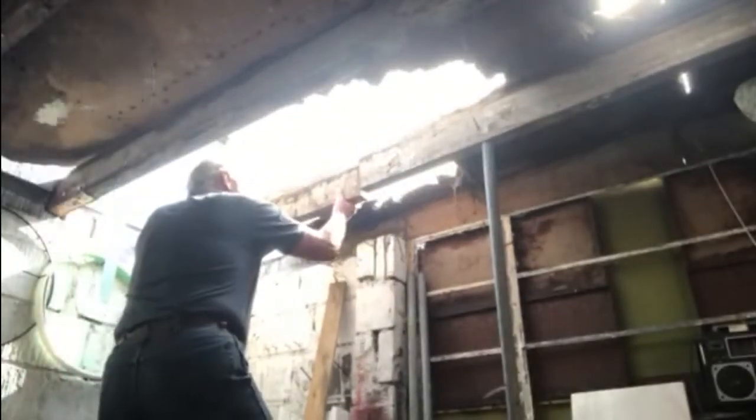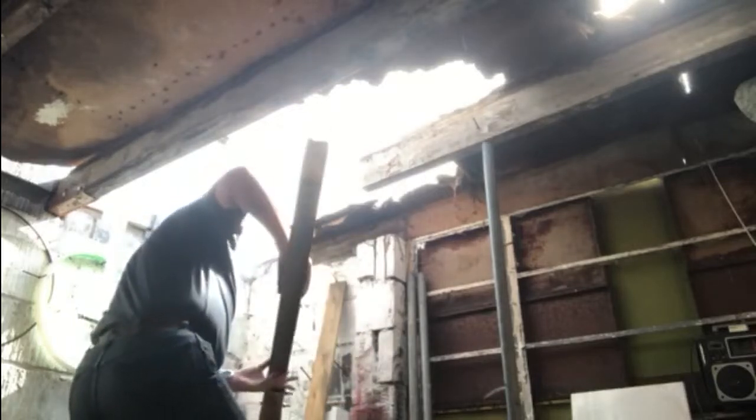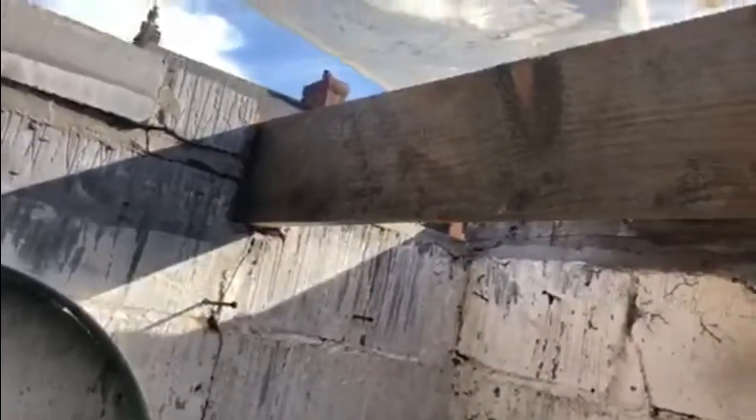Well, that went a lot easier than I thought it would. All I've got to do now is get it down. That's the new bit in - new bit of joist. I've got it clamped just underneath just to hold it level when I put the sister on. Those two bolts are just hanging in there temporarily till I get the other two holes drilled all the way through, and that can get it all connected up, take the clamps off, and hopefully it'll stay in place.